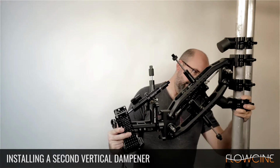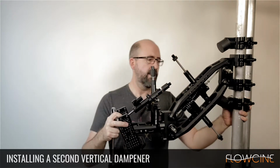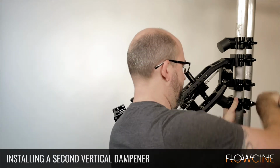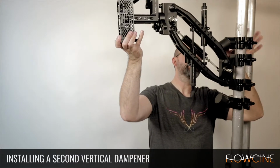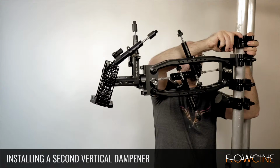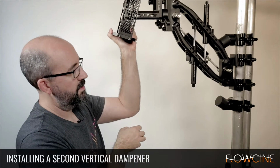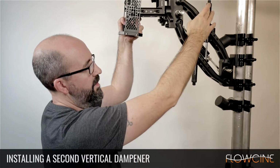Yeah, so I can just give it. I want it to be touched when I have like 0.5 millimeter, 1 millimeter before this rubber end stop on the dampener itself. It's better if it hits the external one than the dampener. And the same thing here. I'm just gonna move this one up a little bit. So I think I'm roughly in the same angle downwards and upwards now, and it touches the external rubber stoppers right before it touches the end stop on the dampener.